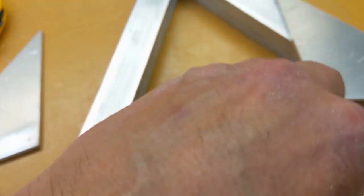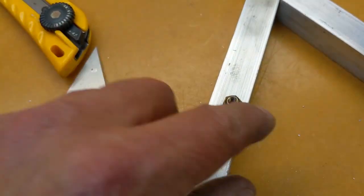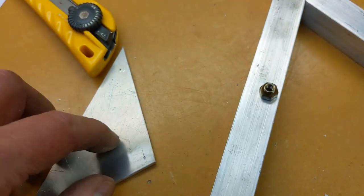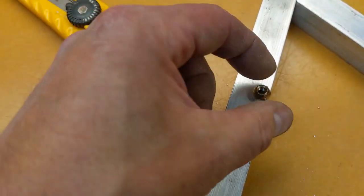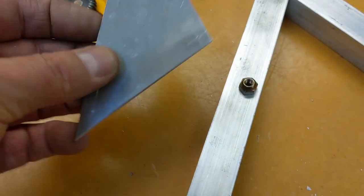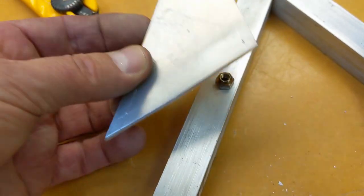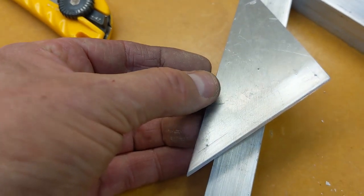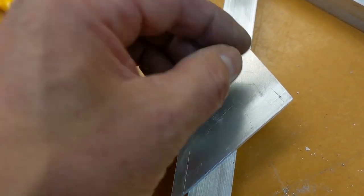So countersink a hole so that it pivots on this bearing surface, just barely. It doesn't need to pivot much. So just a little bit of a counterbore in there, and it'll be able to pivot on top of it. And then Loctite a fastener on top so that it doesn't fall out, just to be on the safe side. And that will manage that piece. And then similar, but in nylon, or maybe even get some of these in nylon, get them a little larger, although those seem all right.